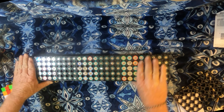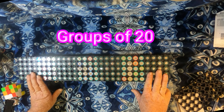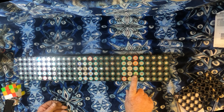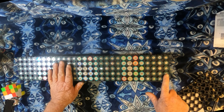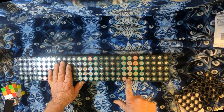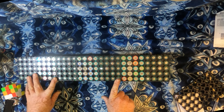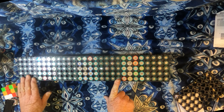I've got them all sorted into groups of seven, and they're flip-flopped — positive, negative, positive, negative — like in the back of a remote control. I go through to make sure none of the cells are upside down, because that would be bad when I go to weld them together, and I make sure all the positive sides have their insulators on.